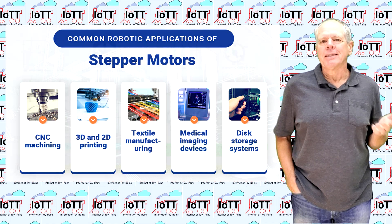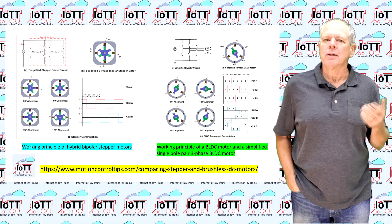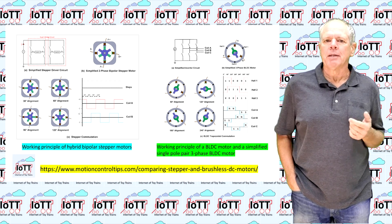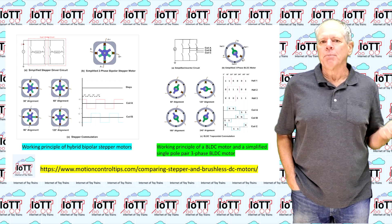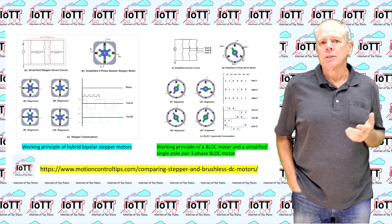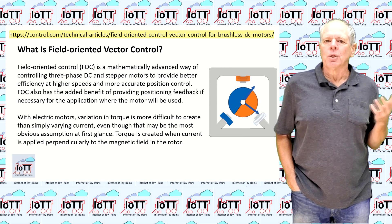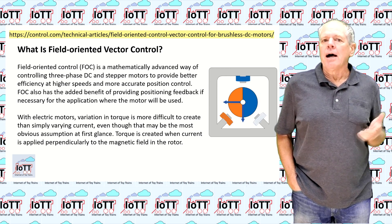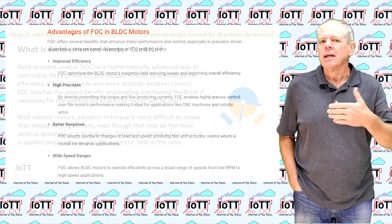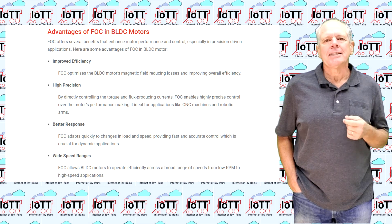In recent years, however, the trend is going towards using BLDC or brushless DC motors for certain high-performance applications. BLDC motors offer higher torque and maximum revolutions per minute. And instead of using simple predetermined steps, they can rotate continuously and with the right controller it is even possible to implement so-called field-oriented control or FOC, sometimes also called vector control, which allows setting the orientation of the rotor in a continuous range from 0 to 360 degrees with no predetermined steps, while maintaining a high torque on the driver shaft, even at standstill.